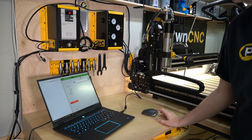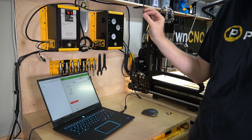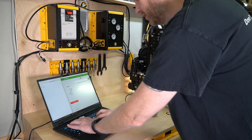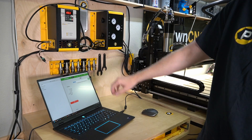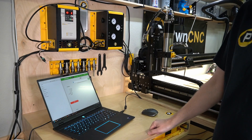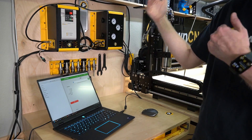If I type in M3S6000, it's going to basically say start the spindle running at 6000 RPMs. Since 5500 is basically when the IoT relay will trigger the shop vac and turn it on, I went ahead and unplugged it just so we don't have to hear the noise. If I hit Send, we'll notice that the spindle automatically turns on. At lower RPMs there's more variance in the speed. If we jump that up to M3S12000, it goes up to 12000 and the variance is quite a bit lower. Hit M5 and that will stop the spindle — once it goes below a certain voltage it will automatically trigger the blinking, which is the stopped mode.